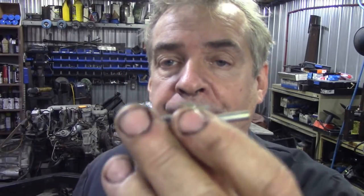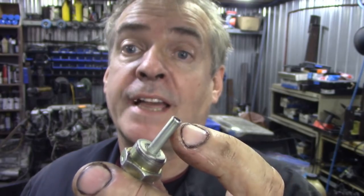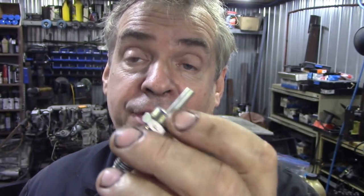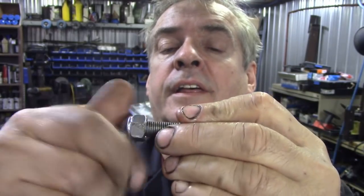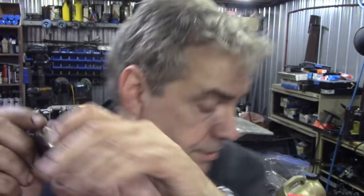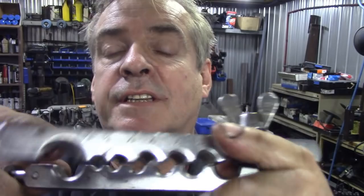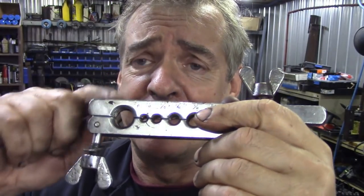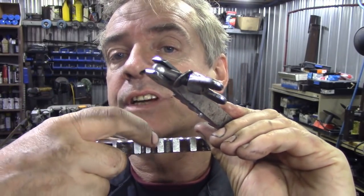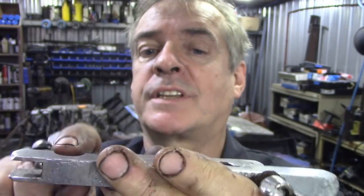See, there's a tube in there. Nothing fancy, no barbs or burrs or anything like that, but the one I chose had some little rings in here to clinch it even tighter. So, 7/16 UNF nut, screw that onto there so you don't damage the top. We've done this with the breather pipes, but this is taking it one step further. We get one of these clamp bars, and these come with those really cheap pipe flaring kits, which are no good for the pipe flaring, but this is actually worth its weight in gold, because you can see there's like thread cut into here. So when you clamp your pipe in here, your plastic pipe sticking through like so, warm the pipe up with a gun.